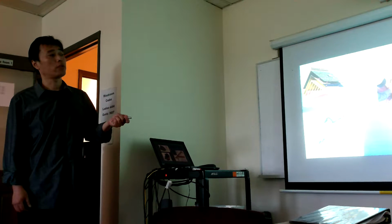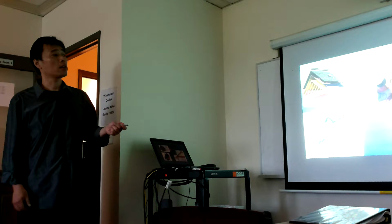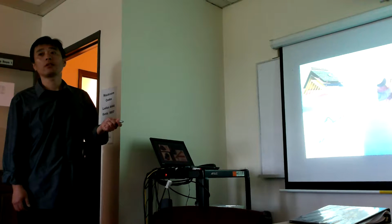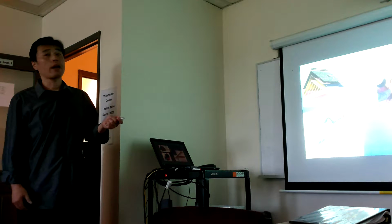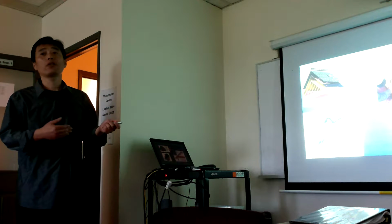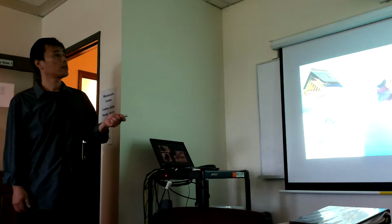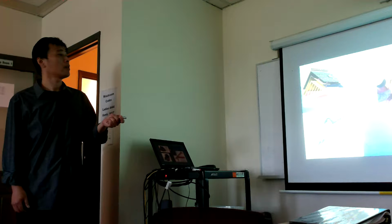That's very important to keep the roof safe, to keep the temperature inside. Because you see, we don't put insulation here. We just put insulation here. That's enough, because we need to keep the whole attic ventilated all the time. That's very important. This is called attic ventilation. We put it there just to make sure the air can go through the edge of the roof.